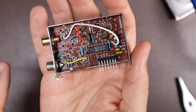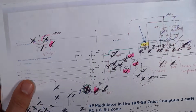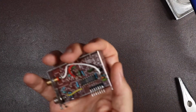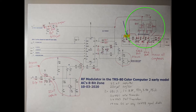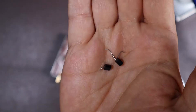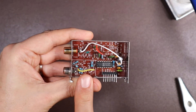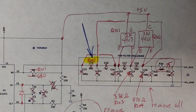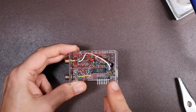I've had a good look through the modulator and I've been through the circuits on the circuit diagram, marking everything off, and I'm pretty sure I've done everything I was supposed to do. The only thing that was bothering me was the location of these two transistors — so I've taken those out. I'm going to check them in a circuit tester to make sure I've got the pins in the right orientation and put them back in the board — probably put new ones in — hopefully this time the correct way around and not contacting anything they shouldn't be.